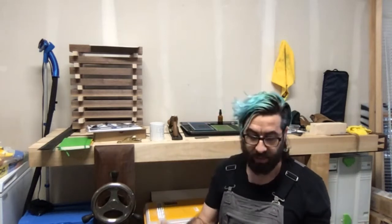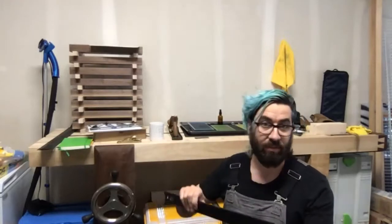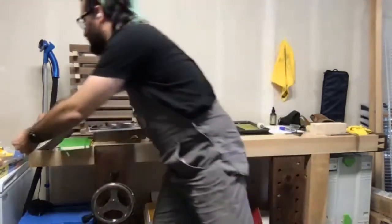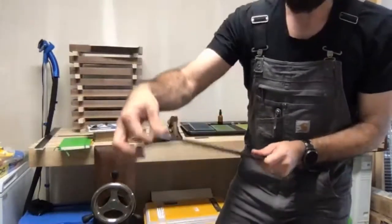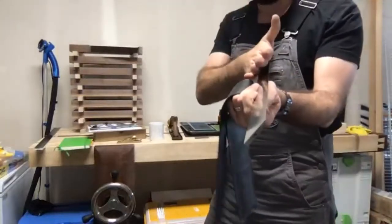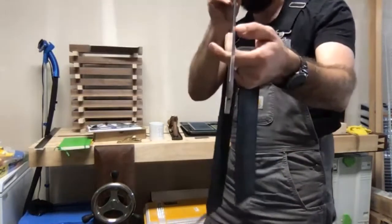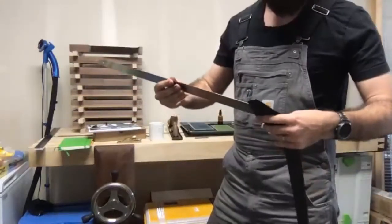Now, there are methodologies for using a single surface to flatten. That's with a feeler gauge, which are little thin strips of metal that you slide underneath to find the low spots. Or you can get a more expensive straight edge. So this here, the big flat half is perfectly straight, and this beveled angle is perfectly straight. And together you end up with a line that is dead straight. The same thing is true with your blades.